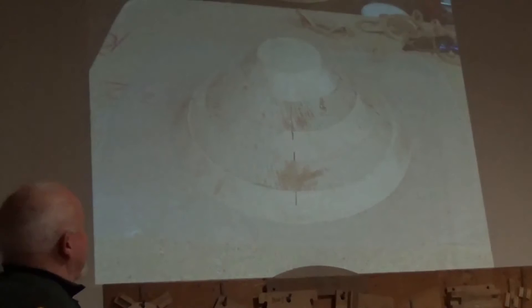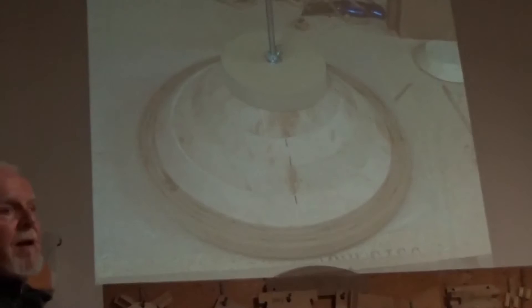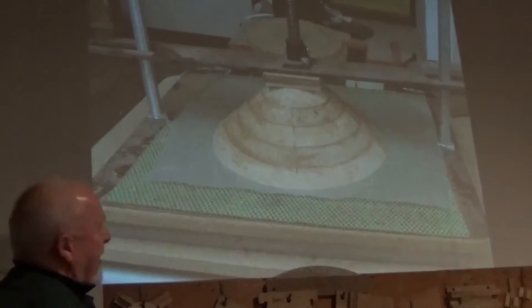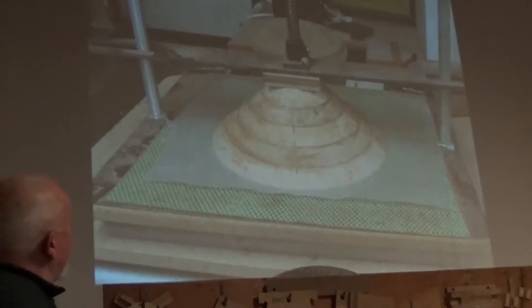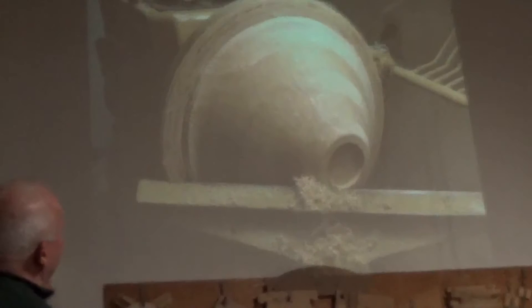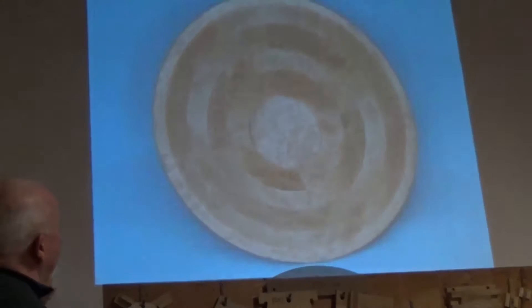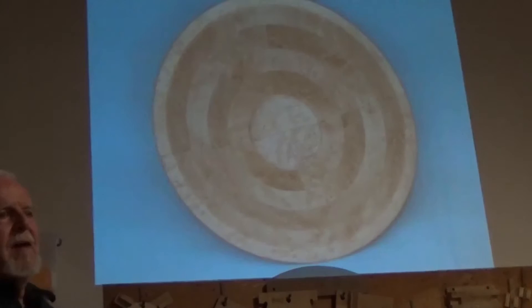That's one clamping fixture you can use before you put the bottom on — real cheap if you don't have a big wind-down clamp. Or I made a clamping fixture and have a handout to show you how to do it. Then I turn that recess and put my chuck in there, but I've already turned the outside. I use bird's eye maple for that, so it's already going to come out looking great. That's the finished bowl. I don't love that I can see the seams, but it was a really quick, easy way to get a pretty nice bowl made.